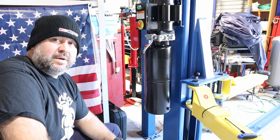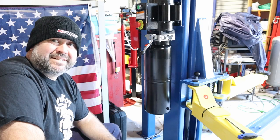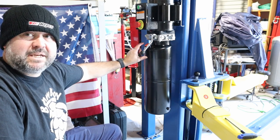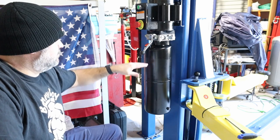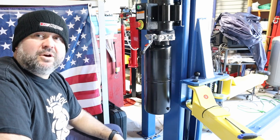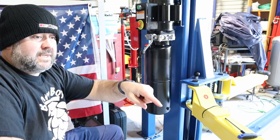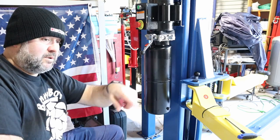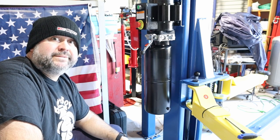Okay, so I've just filled it up. I think I forgot to press record. Excellent. So it takes about 12 litres. There is a dipstick on the cap with a minimum and maximum level, so I'll fill it up to about max. Still got to fill up the hydraulic hoses and that type of thing. Make sure all your fittings are tight down. There's only the T section at the back here and the bottom of the columns. Otherwise, we'll get fluid everywhere.